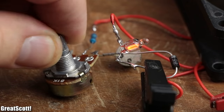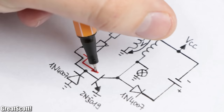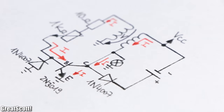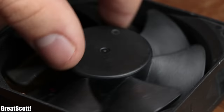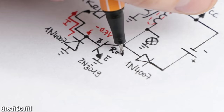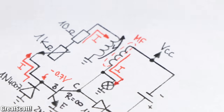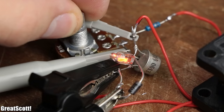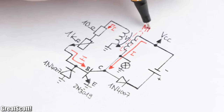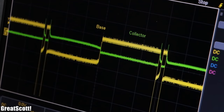The reason can be found when we analyze the circuit. First, we spin the rotor so that a positive voltage is induced into the base-side coil, which pushes current through the base of the transistor. This opens the collector-emitter path, allowing current to flow through the other coil, which builds up a magnetic field and keeps moving the rotor. A negative voltage is then induced into the other coil and applied to the base, closing the collector-emitter path. At this point, the stored energy of the coil's magnetic field gets pushed into the neon bulb, resulting in a small voltage spike and a brief moment in which it lights up. Then the base-side coil is again induced with a positive voltage and the cycle repeats.